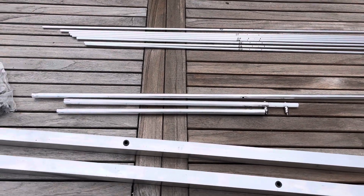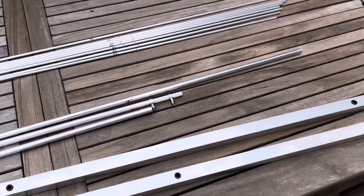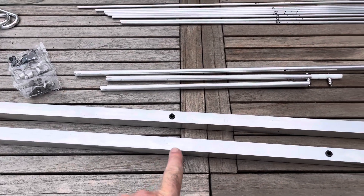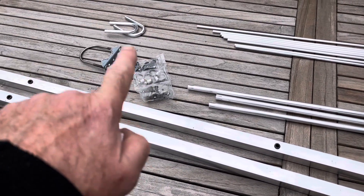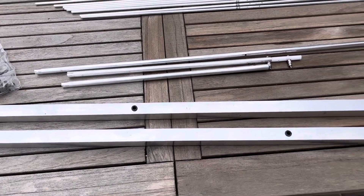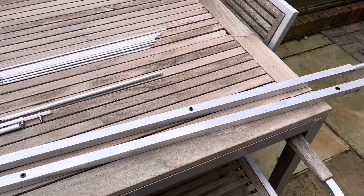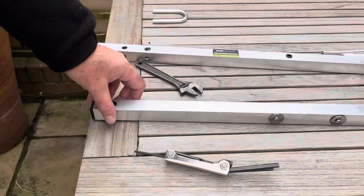Hello and welcome to the channel. This is a deconstructed 9-element 2-meter Yagi — a new acquisition to replace or complement the 7-element I've already got. It's an Innov-Antennas Owl Ultra. You can see a one-inch boom with solid rods for the elements, a dipole with attachments, and trombone ends for tuning. This is significantly longer than my current Yagi at five meters — the current one is three meters — so this is on the limit of what I'll be able to push up the push-up mast.